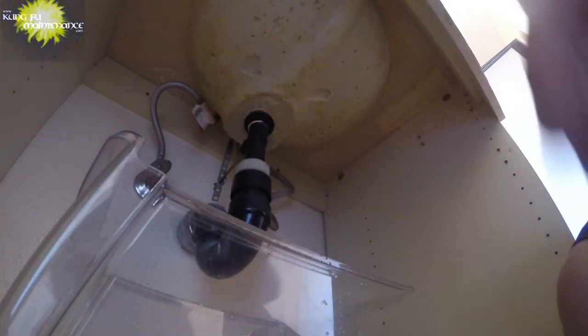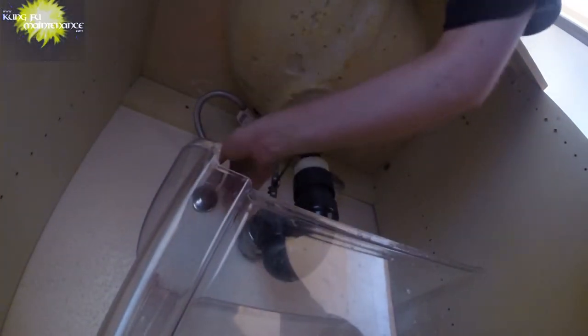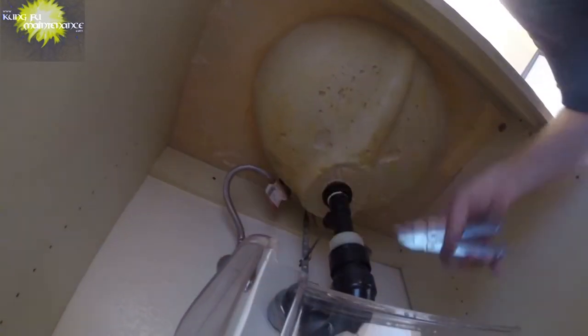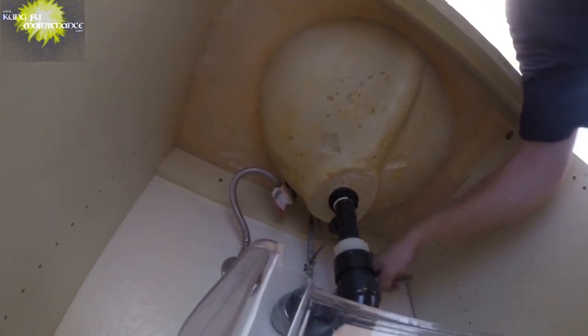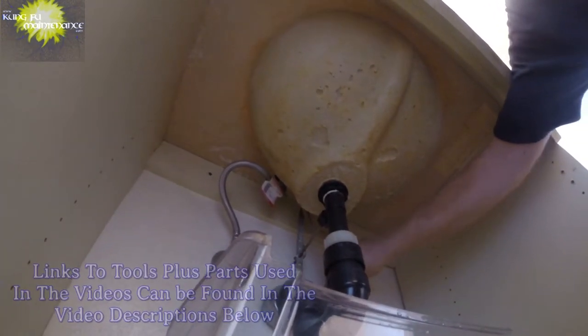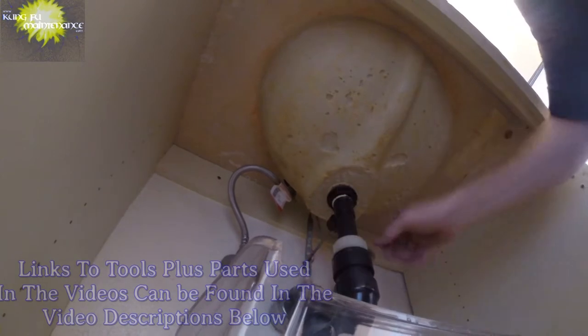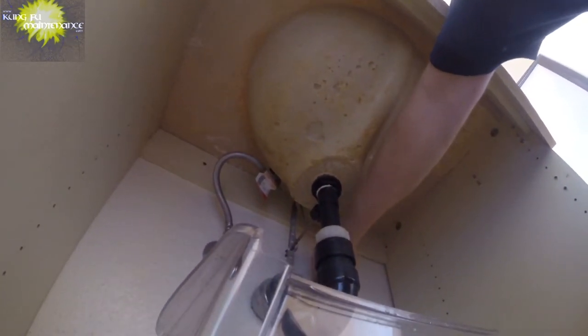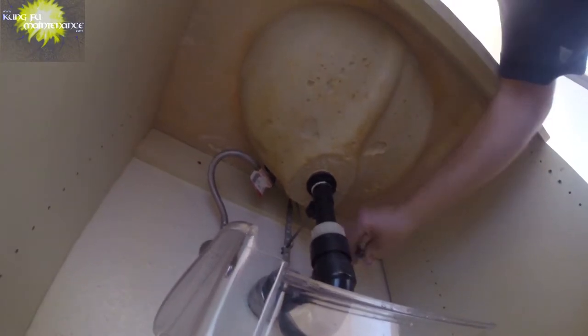First, I've shut off my water supply, verified that everything is off there. Turn these off, and then just going to pretty quickly loosen these and disconnect these. We've got to disconnect everything to get the sink out. And we want to maintain water in the trap so that the place doesn't stink. And so here goes our supply.